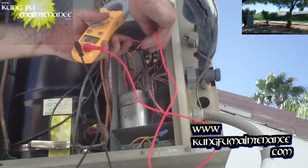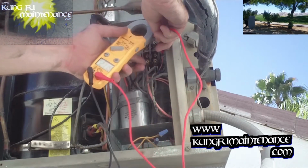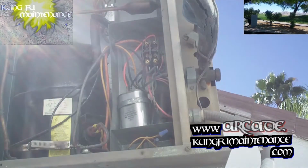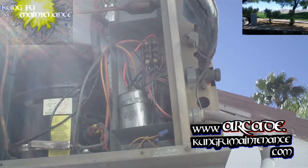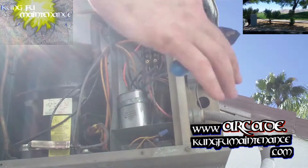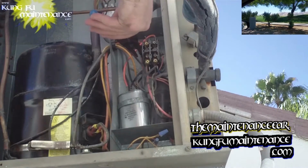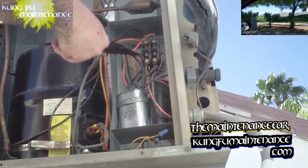The dual pole contactor's advantage is that it cuts off power completely on the top half of the contactor, the line and the load, the L1 to T1 or L2 to T2. And so in a sense it may be a bit safer, especially for ground units that are on the ground versus units that are on a roof or hidden away, although it's debatable.